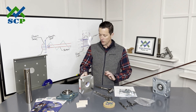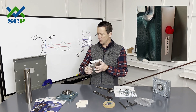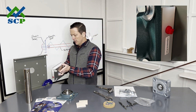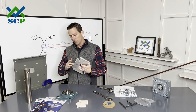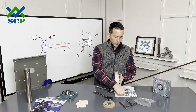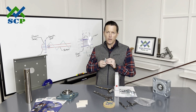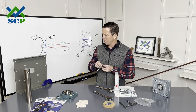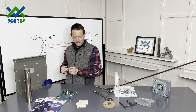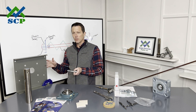You also could just not do that. The first thing you can do is go ahead and get our seal mounting. I like to have the adjustment port where you can easily get to it — our flange on top of our conveyor can interfere sometimes. So I like to make sure we have our adjustment port and our purge port facing out left to right. It's hard to hold all these components, but I'll go ahead and give it a shot.